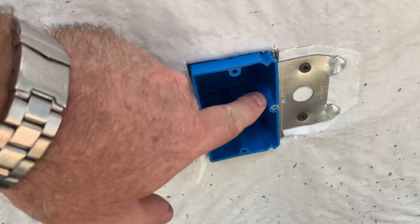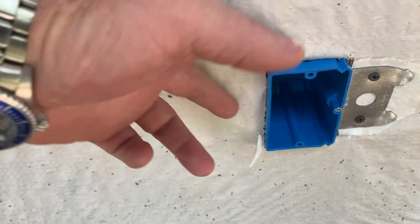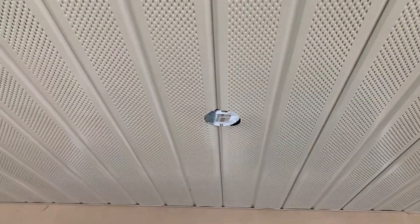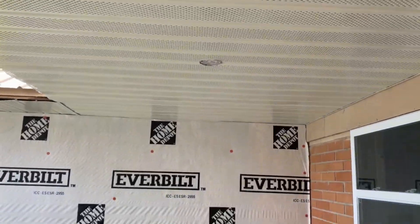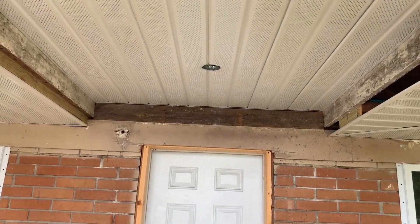You fasten with the face into the stud, and once they're fastened, there's a little screw you can turn in or out to adjust the depth. We're going to come back later and put some hardy siding on this with a three-quarter block, so this is going to have to come out three-quarters — we can adjust it right on out. We also went ahead and mounted a fan box here, center of these windows, for our front porch. I don't know if we'll put a fan out here or not — if we do, great; if not, we'll just put a light. And over our front entrance we've got a light — we're going to hang a pendant light there, like a chandelier sort of.